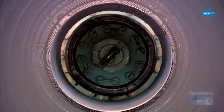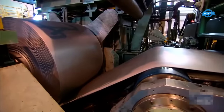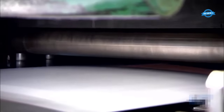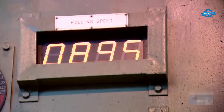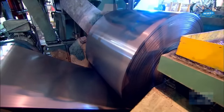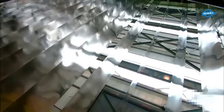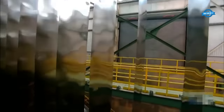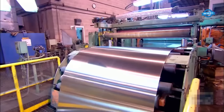During the rolling process, the cold steel hardens, closing the pores on the surface and giving it a shiny appearance. The final treatment gives the stainless steel its dazzling finish. When exposed to atmospheric oxygen, the chromium in the steel forms an oxide film that protects it from rust. Finally, rotating knives trim the edges and cut the sheets to the required dimensions according to customer specifications. It truly is a brilliant process that produces high-quality stainless steel products.